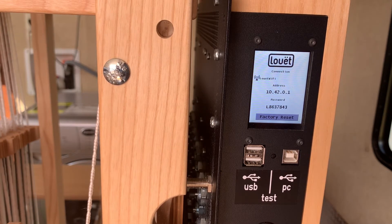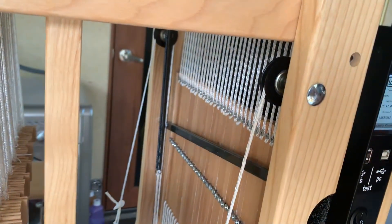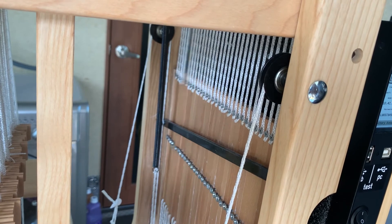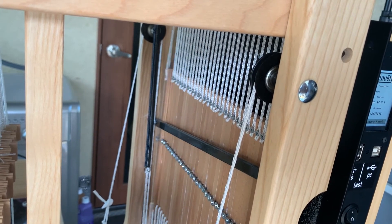It will cycle through 1 to 32, or 1 to 16 if you have a 16-shaft Dobby. You can just visually check by looking down from above that each of the solenoids are firing. You can also look at the Dobby hooks themselves as they fire to count that they are all indeed firing — you can see the Dobby hooks push out one by one — and just check to make sure everyone engages and then disengages to make sure that's all working correctly.